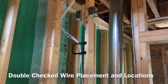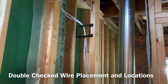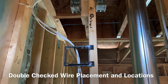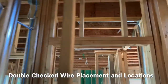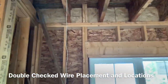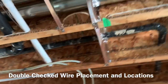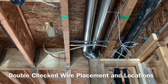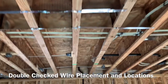I ran two sets of wires — one to the wall controller for each speaker pair and one from the wall controller to the speakers. During pre-construction I used construction templates to mark out positioning for the wall plates, ensuring we'd have power and CAT5 or CAT6 for internet connection. I marked out the location of the two rear-channel surround speakers with green tape, making sure they were symmetrically on either side of the main listening position, and made sure the speaker wire was safely tucked up underneath the floorboards and away from any contractor equipment.